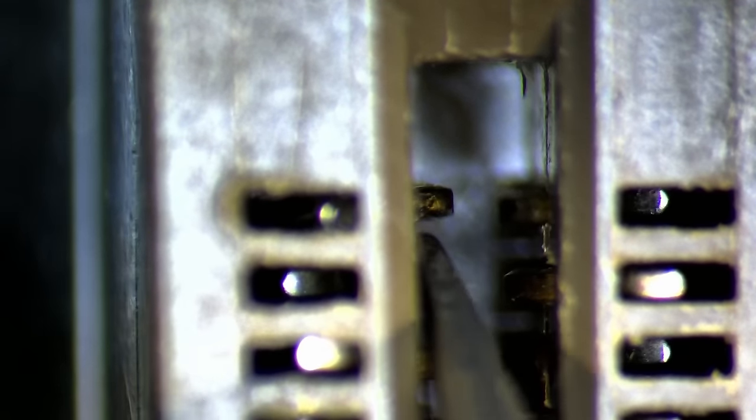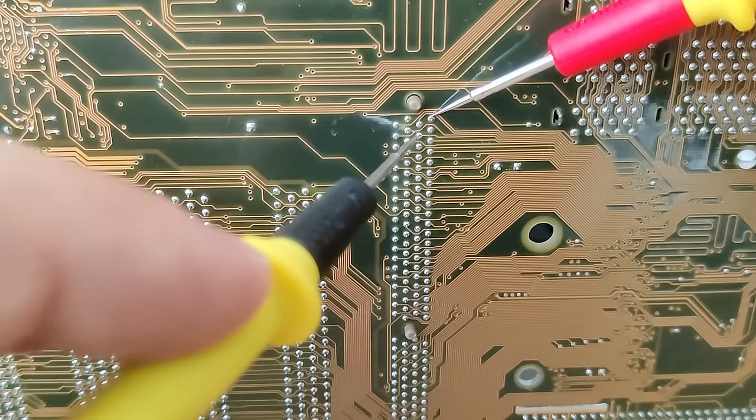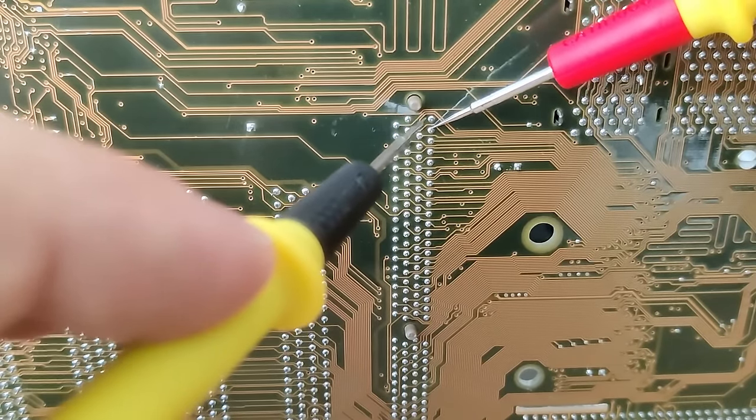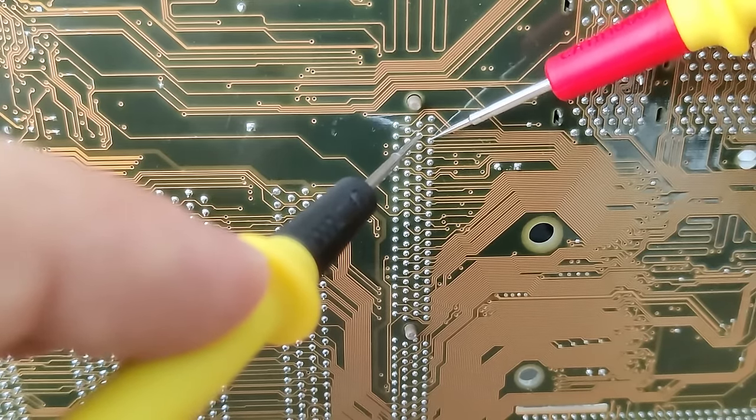I'm surprised too. It is hard to believe that I could fix this AGP slot. Yet, here it is, flexing all its 132 pins once more. Before powering on the board, however, I double and triple checked the AGP slot. With an inserted graphics card, I tested the contacts around the fixed pin with a multimeter to be sure there were no surprises with bridged or shorted signals.